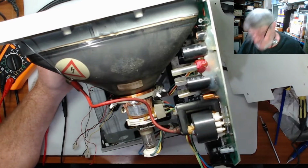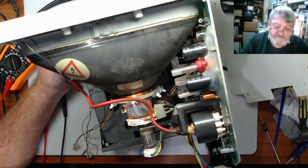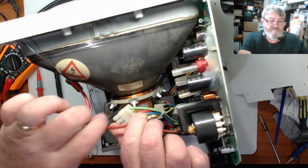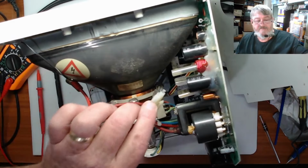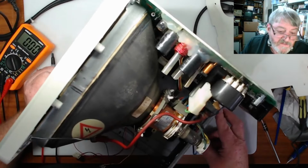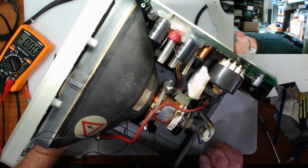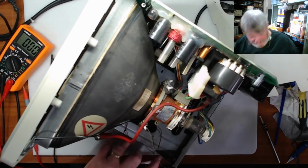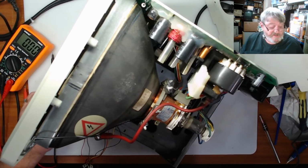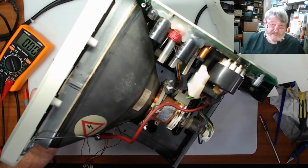Other than replacing that transistor, I haven't really done much more to it. So if that was the voltage it was set to originally, that must be okay. I think I might plug the screen and that back in, and the connector's on. I might just give it a go, because it beeped for us, which means it is getting power through and starting up, which is more than it was doing originally. It was just dead. So I'll plug everything back in and we'll give it another go and see how we go from there.